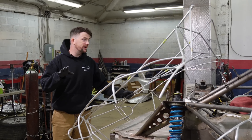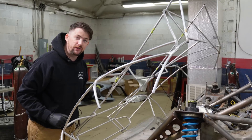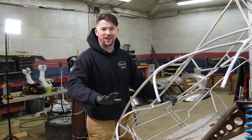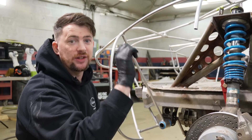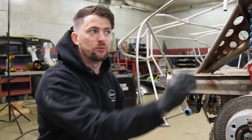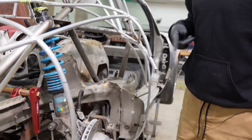Our clamshell is 100% functioning now and very solid, but not as solid as I'd like. The main issue is that right through the middle, if you did a cut through, there are five major tubes that attach everything and they're all in a straight line — not triangulated at all. What I'd like to do is add a partial wheel arch and tubing up through here. Since this tubing is a little girthy, I don't want it right up to the edge of the tire. I'm going to use TIG wire and run it across the tubes, then bend some aluminum tubing and load it into place.